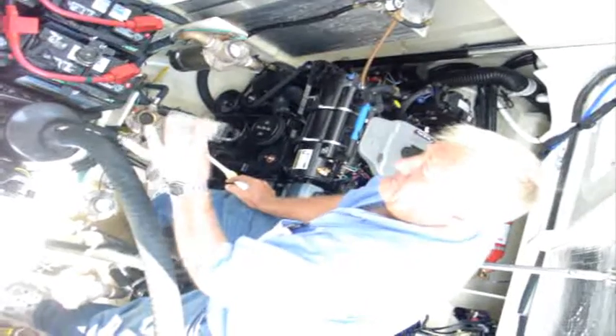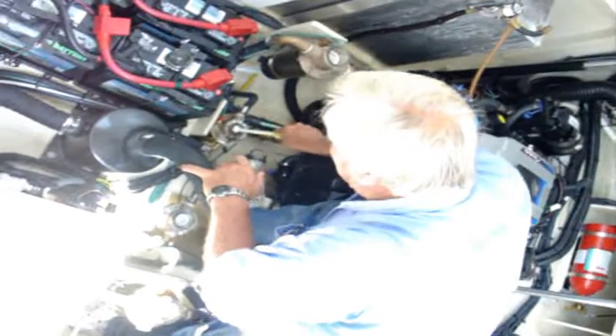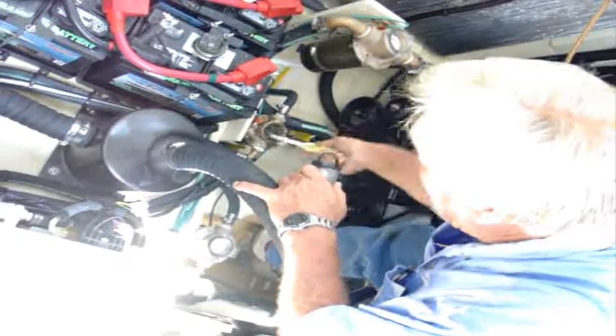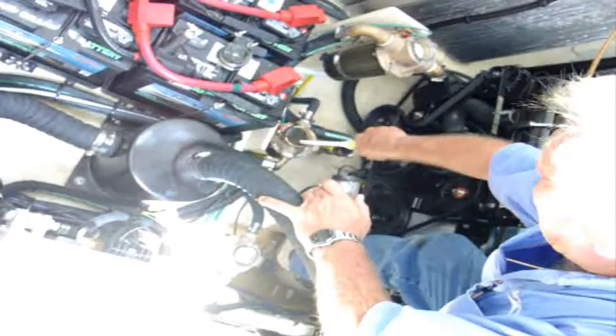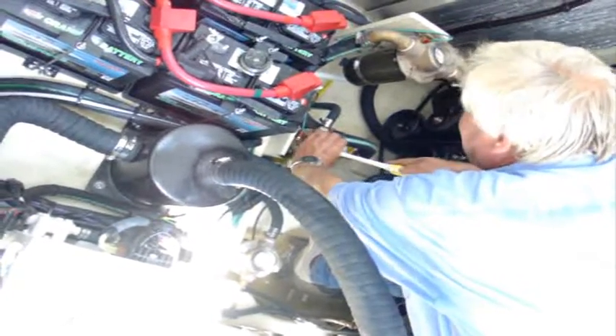Now that I've cleaned my basket, I'm getting ready to go back inside, but I want to clean that surface on the inside of it. Get all that crud out of there, loosen it up, clean the screen. Most of the time you can see through it to see the basket whenever you're cleaning the sea strainer. If they're dirty, nine times out of ten, it's time to clean them.